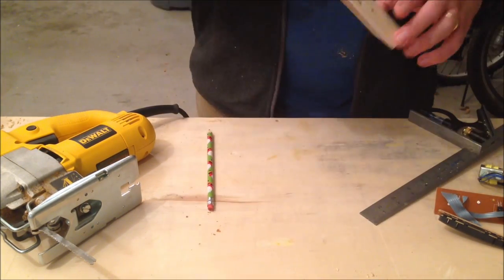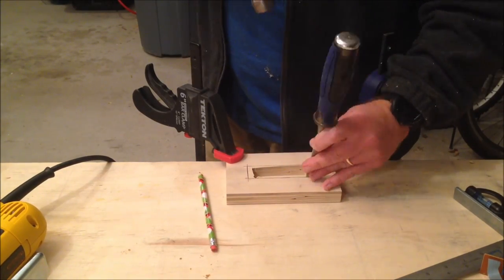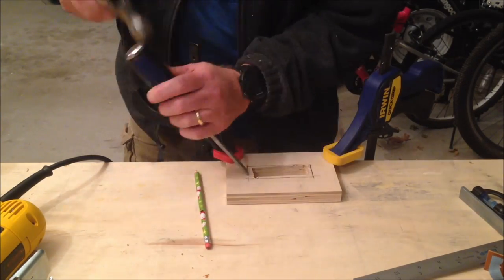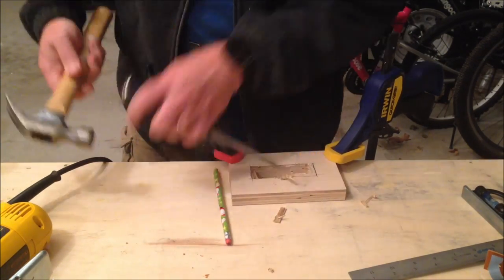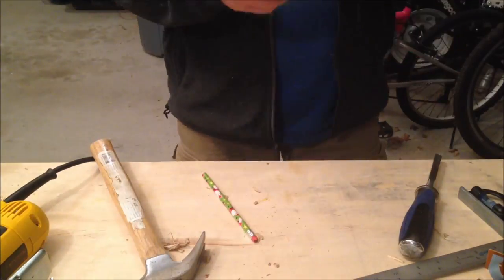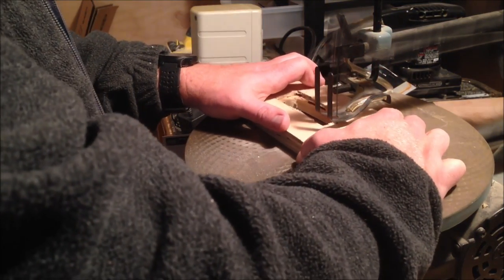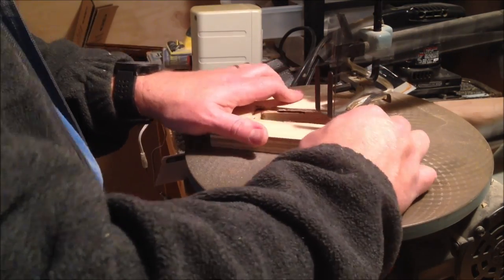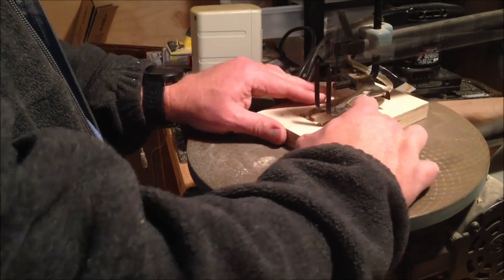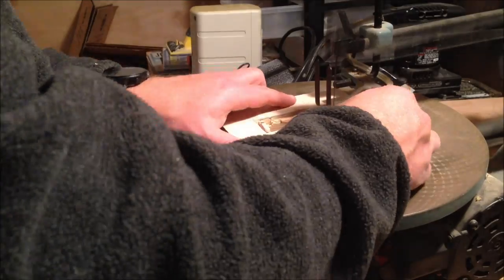So I made the opening bigger and tried to use a chisel to open it up more, but this was really an exercise in frustration. Using a chisel on plywood just didn't work very well. So I moved over to the scroll saw, and this made quick work of cutting the opening. The sides were nice and square, unlike they were with the saber saw, and it worked really, really well. It had square corners and square sides, and the opening was exactly the right size to fit the whole board in there.